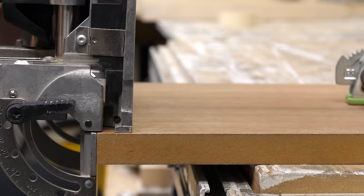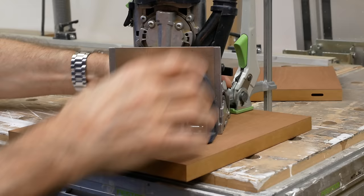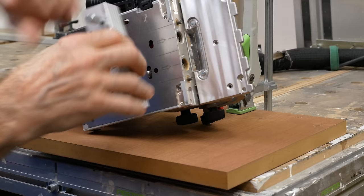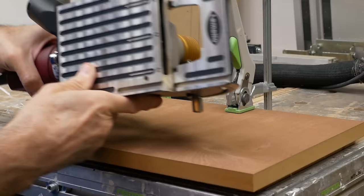When it comes to putting fixings in the face of the board, all three machines need a little extra support, as they only have half the thickness of the board available. Festool's answer is a slightly janky-looking plastic base support bracket which, despite its looks, actually does a decent job — even if it is quite hard to hold. The Mafell bracket is a really nice workmanlike extrusion that does an excellent job and proves comfortable to use. And the Lamello has a very well-engineered and machined angle bracket that locks smoothly into place.